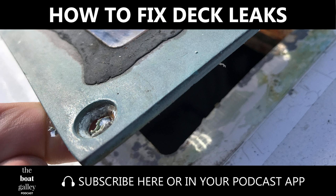If you're being particularly thorough, you may want to take a bronze brush and really truly get every single last bit off. If there was stuff being particularly stubborn, I would put a bronze wire brush onto a drill and use an electric drill to help truly clean all that off. You also want to clean all of those surfaces with some kind of degreaser. The sealant you've used will often be a little greasy or have tackiness left to it. You can use something like acetone or alcohol — it's not particularly skin friendly, so be careful and make sure you wear gloves.